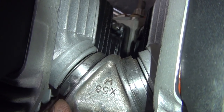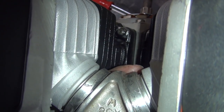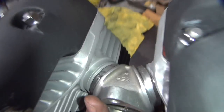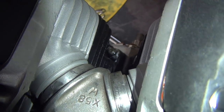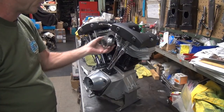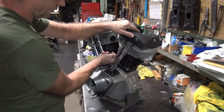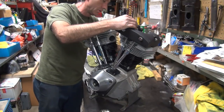The problem is when you put the o-rings in it squishes the manifold and pushes it out like this — I can't spread the manifold enough to make it go in there correctly. If I loosen up these base nuts a little bit I can probably get a little more rotation out of this motor, it'll help line things up better. Overall it's pretty close. I'm going to run it the way it is — I don't know if it'll get any better if I moved it out or not. Usually what I do is put the manifold on, get it lined up, and do my final torque on everything.